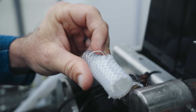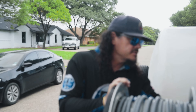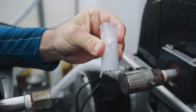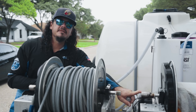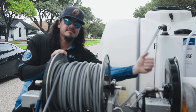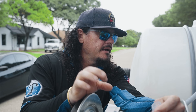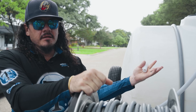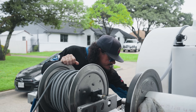I hadn't noticed that the line was bulging there, but it probably was. It's not a bad idea when you start up your machine to go around and look at all of your connections — sometimes you'll have a connection that slides off, sometimes you'll have a rupture in the line itself. Whenever you're putting a new hose on a line and you put these clamps down, tighten them down as well as you can without damaging the clamp, then come back maybe the next day and cinch all those back down again — because the rubber on the hose will be compressed a little bit under that clamp and then give it a little bit of wiggle room. Always check your connections.